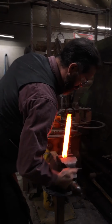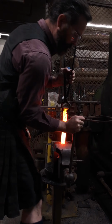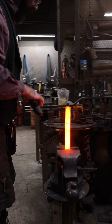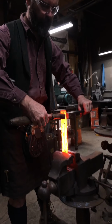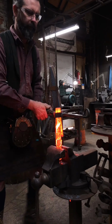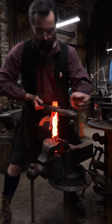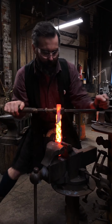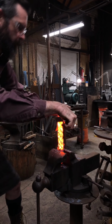So, trick to it is get it hot, lock it in at one end, get plenty of force on it, and then away, lock it in on the other, and apply rotation. As you're twisting, be careful to not get excessively uneven forces, because if you do, wretched things will corkscrew on you.